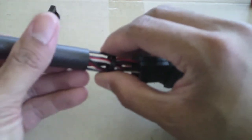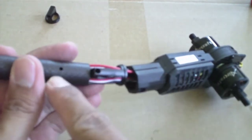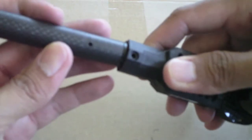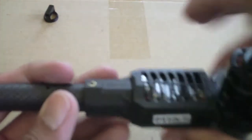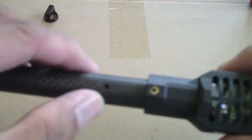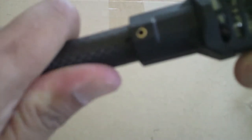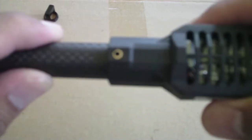Now place the strengthener and make sure the holes in the strengthener line up with the hole right here — that's where you're going to mount the screws. Screw it in. Now that you've fished through the wiring, attach the frame arm onto the motor mount and slip it in. Make sure the screw hole is lined up.